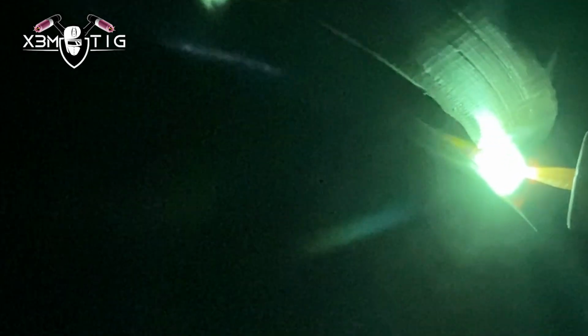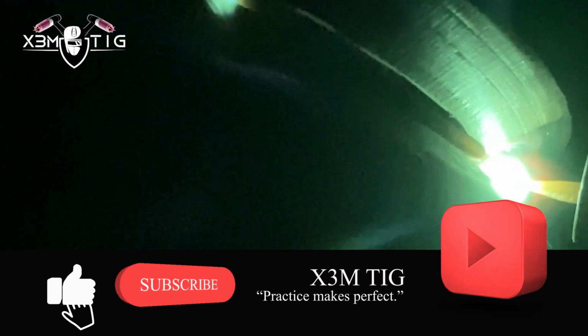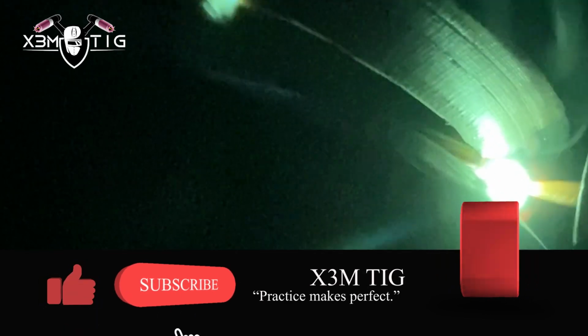You always want to do freehand. That's something that you want to practice. Freehand is always option number one. Honestly, with freehand, my root looks way better than when I'm wiggling or walking the cup on my root pass. You just focus more. You got more control.